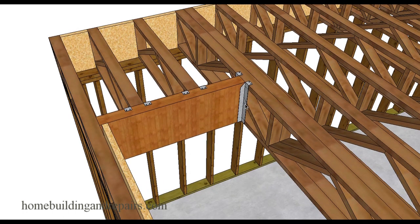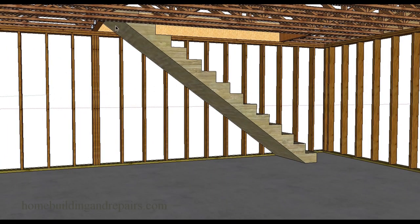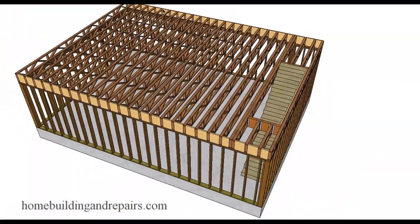On the other side, a double hanger for the beam and then hangers for the joist. If you had a wall here you could probably get away with a single floor truss, and you could probably use a conventional beam - you wouldn't need a floor truss for something like that. Stairways that run parallel to the joist will require less effort; you'd be able to use more conventional standard size joist from a lumber yard, and this system could actually be conventionally framed with 2x12 or 2x14.